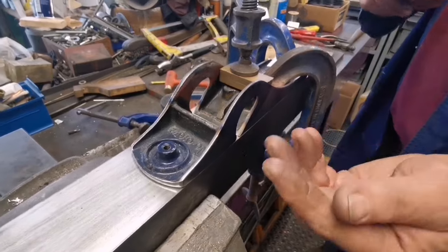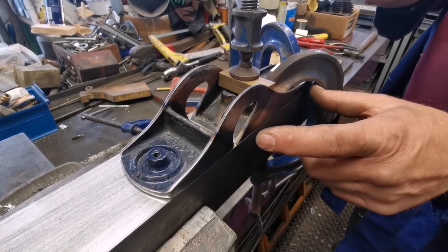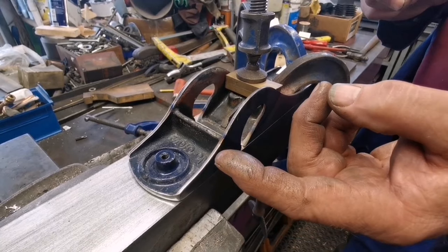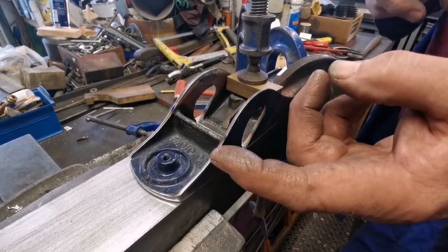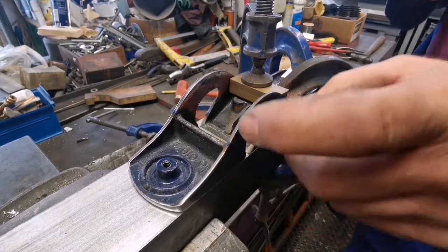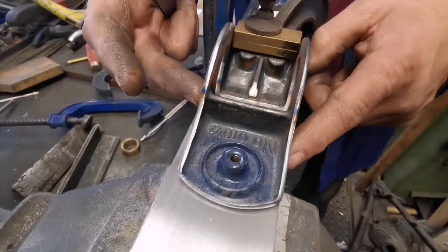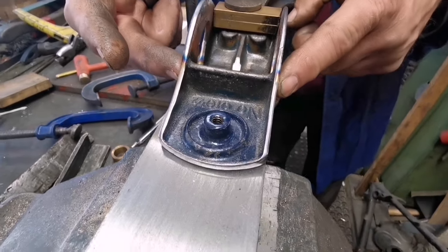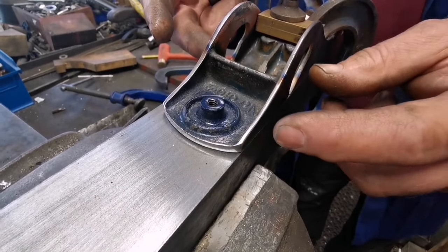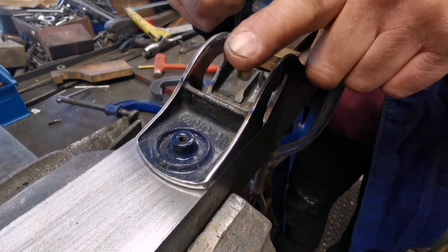We've got two ways of doing it. If we have an issue with the nose lifting up despite being clamped down, we can stand this body face on a bit of shim material, so that face is artificially high. Then when we apply the clamp pressure while it's warm, it will artificially over bend it, to allow spring back, to get us flatter. And equally here, we've got to guesstimate how much we're over by, 15, 20 thou. Then we'll cut ourselves a little piece of shim, which we can hold in place. So when we rewarm, we'll over bend to allow a bit of spring back.